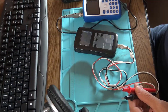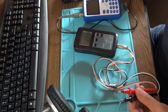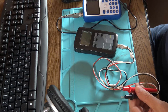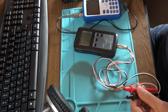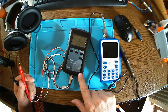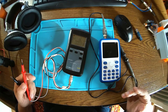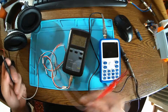For impedance, you need to inject a frequency — an alternating current — but the principle is the same: it's always a difference between voltages and currents. You compare a known reference resistance inside the instrument against what you're measuring.